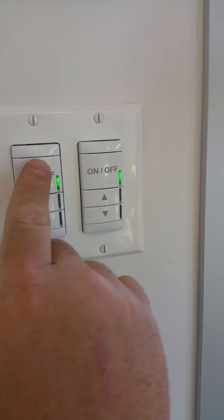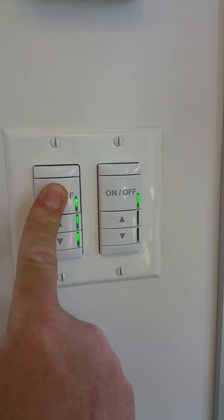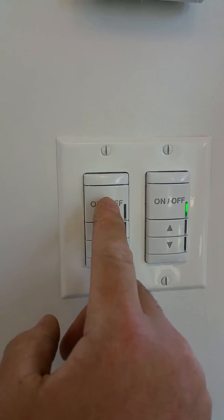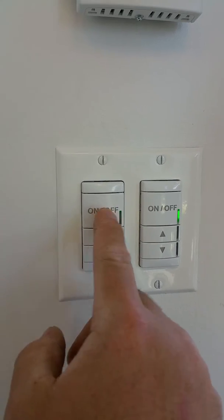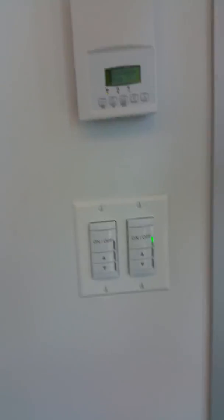In order to do that, you hit the switch until it flashes. Just flash it once — you're going to be on side B programming — so you hit it again until it flashes. Hit it ten times, wait for it to flash, hit it two times, and that's done on the switch.